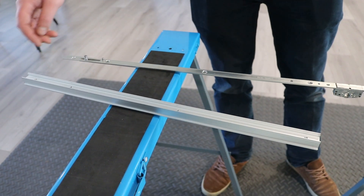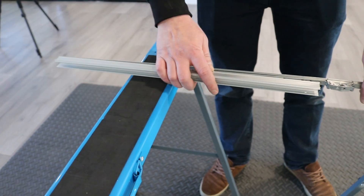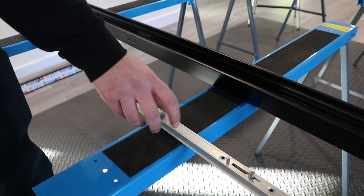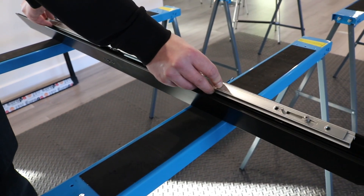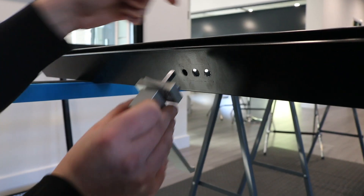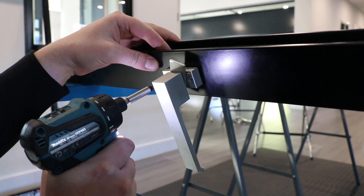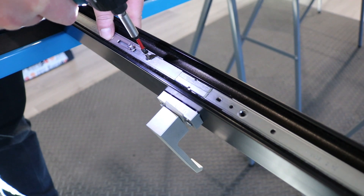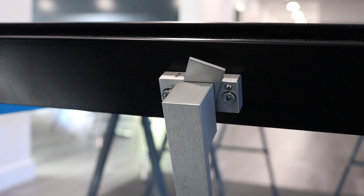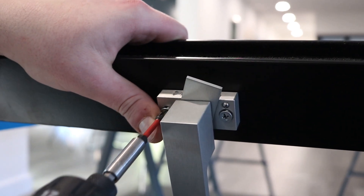For the inline slider lock strips, you will need to cut the TV8011 lock spacer add-on to suit and place it into the profile as shown. Screw on the handle loosely to centralise the lock strip before securing it into place with screws through the face. Make sure the screws go through the add-on and into the sash, long enough to go through the metal strip in the sash. Once the lock strip screws are in the top, you can tighten the handle screws.